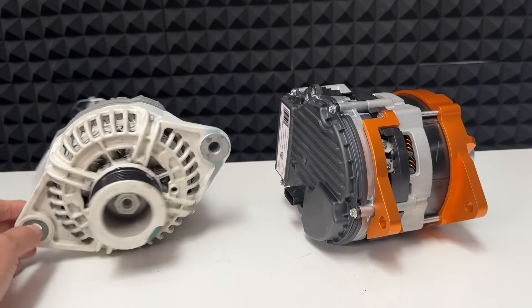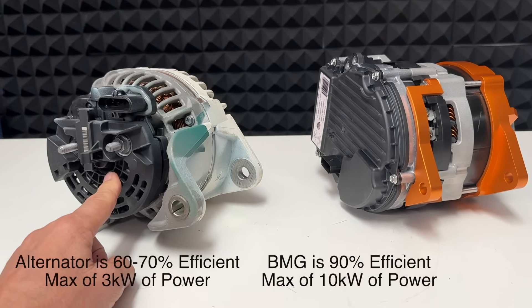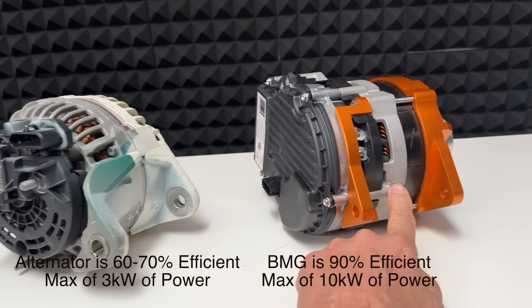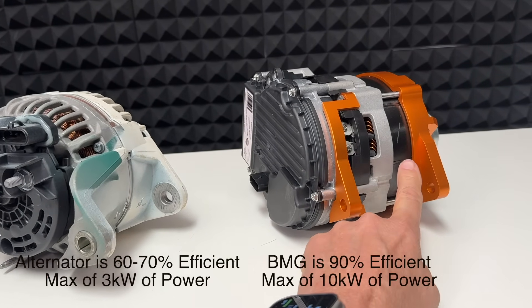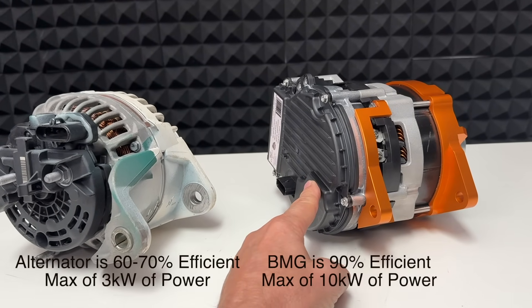What's unique on it is it has an inverter on the back. This unit on the back has got a bunch of diodes — when it gets hot it's maybe 60–70% efficient if you're lucky. This new unit is 90% efficient inside the generator part, and the inverter on the back is about 94% efficient.